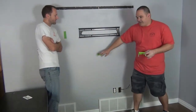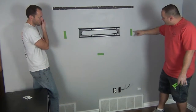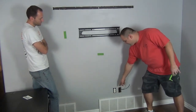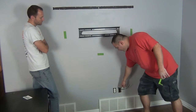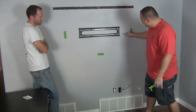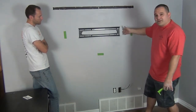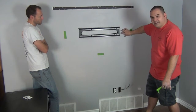I've marked the outer rims of the TV with green tape — right side, bottom, left side — to give a rough idea of how the TV will sit on the wall. That piece of wood between the outlet and the low voltage ring is the stud we're mounting to. So if we're running wiring up the wall from here, we need to go to the right of this stud. My low voltage wiring needs to go to the right, and I don't want to go too far past the bracket because you don't want the wiring to be visible past the edge of the TV.